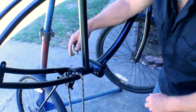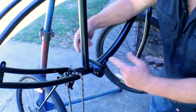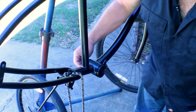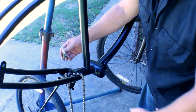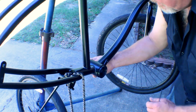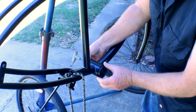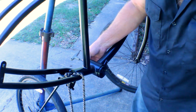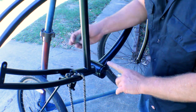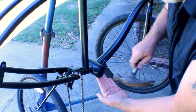Give it a little love tap. I can feel the screw being pushed out on the other side — what we want to do is get the screw to start threading into the bearing plug on the opposite side. I can feel it starting, so I've got it aligned up pretty straight. Let's go ahead and get the other screw in — I can feel it starting to thread in. Let's get our final screw in. You don't want to get them tight, just where you can feel them just start to thread in. Now let's go ahead and tap it in nice and slow.